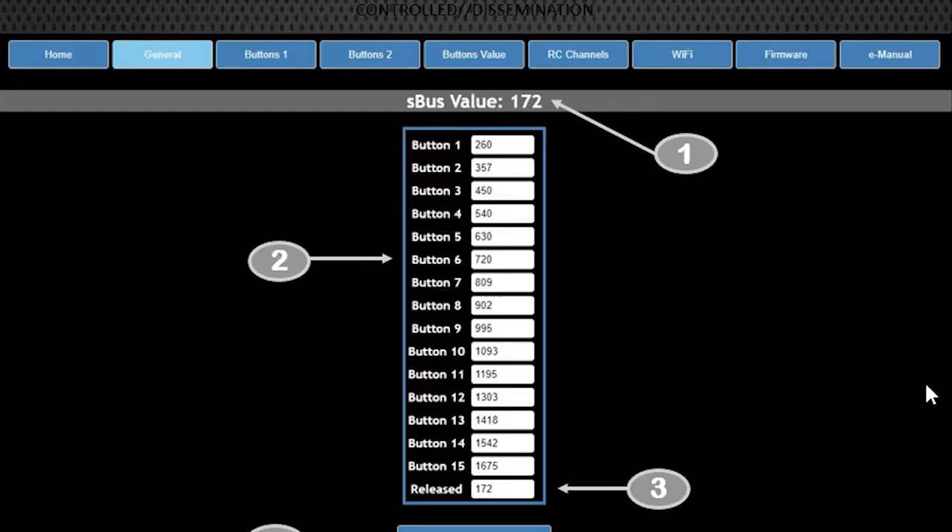I've got to say, Matt, this was my go-to page because it's a great way of telling that they're communicating with each other. Exactly - you can check that the Kyber is communicating with your transmitter. This gives you a good feeling that you've got this right, and if something else is going wrong it gives a point for troubleshooting. As soon as you push a button on the Kyber system and you see the SBUS value change, you're there - you've pretty much done it.